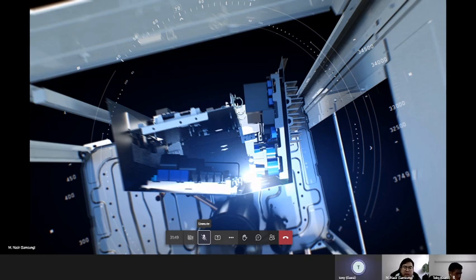Sorry, I forgot to mention, in terms of piping length our CAC is also similar. So basically our CAC and FGM have almost similar limitations in terms of pipe length. Maximum is 50 meters and the height is 15. But for our RAC, the pipeline for 1 and 1.5 horsepower is the same, which is 15 meters. And for 2 and 2.5 horsepower, for our RAC it is 25 meters.